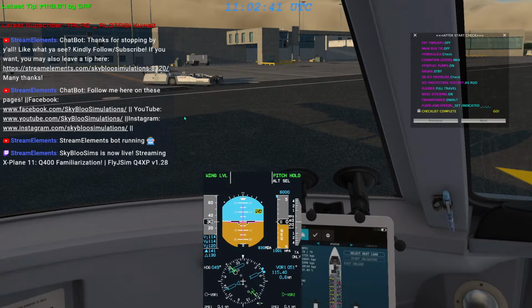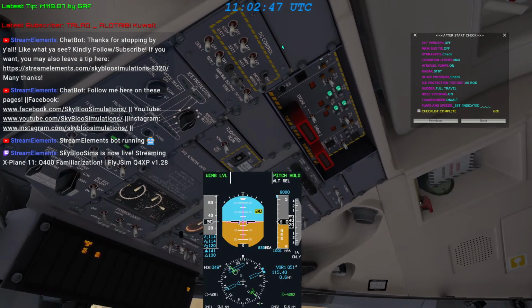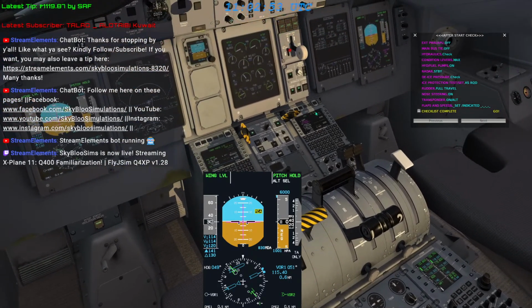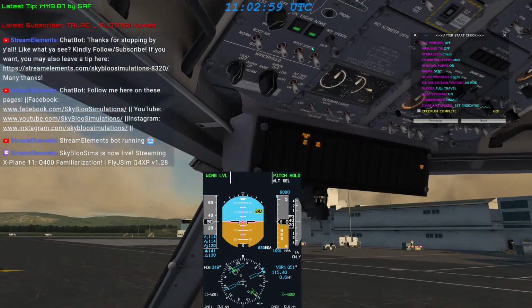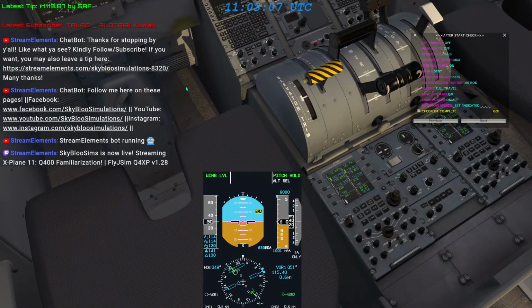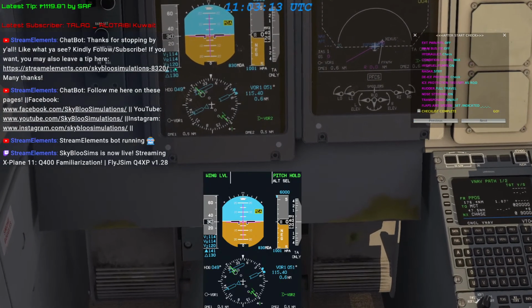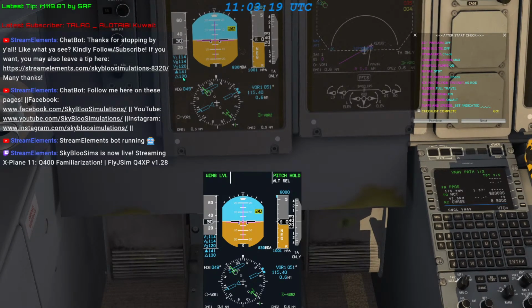Hand signals and pins are received after start check. External power and APU both off. Main bus tie off. Hydraulics check. Condition levers max. Hydraulic fuel pumps on. Radar standby. De-ice pressure check. Ice protection test set. Test and on. Rudder full travel. Nose steering on. Transponder on and alt. Flaps and speeds 5 set indicated. V1 114, VR 114, V2 120, VCLIMB 130, VFRI 141. After start, check complete.